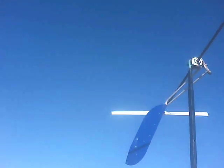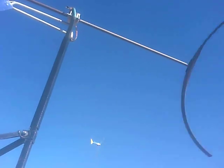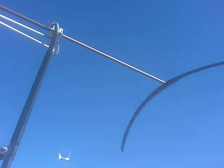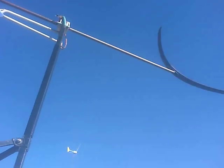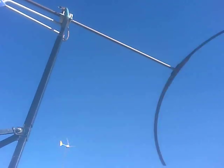Watch your speed because it's going to be unloaded for the first 30 seconds. Hear how loud that is? That's an unloaded wind turbine. It makes a lot of noise when it first starts up until the inverter loads it down after about 30 seconds or so.